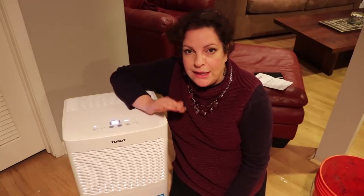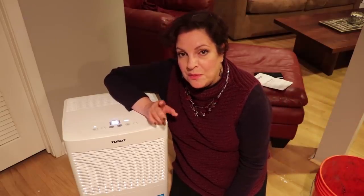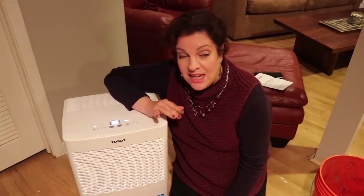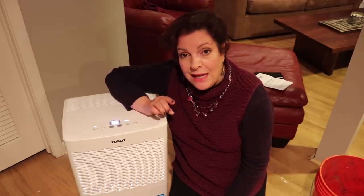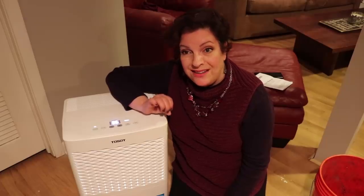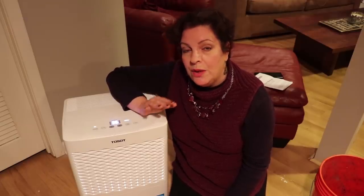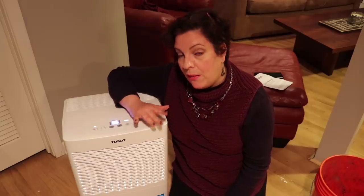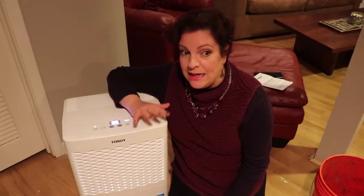Now, this is not really the season for a dehumidifier. Most people actually do the opposite during the cold months — because the furnace is right here, the air actually gets drier in your basement during the fall and winter. Some people with a furnace in the basement actually use a humidifier to bring back some level of moisture, because when the air is too dry it's not great for your foundations, wooden furniture, or anything you want to preserve. Super dry air is not ideal. This unit would probably be more optimal during the spring and summer when it gets really heavy and damp in this basement.